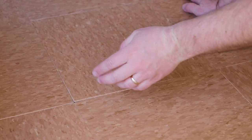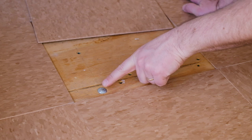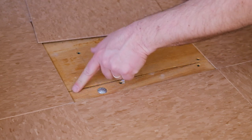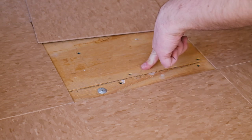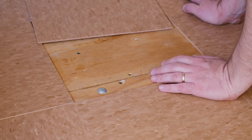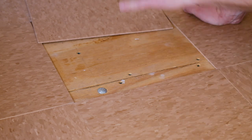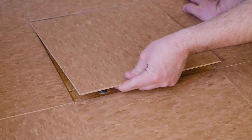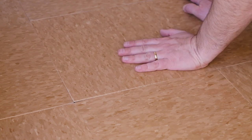One thing with VCT flooring is you don't get away with things like this carriage bolt sticking up, and where these two pieces have a little bit of an uneven gap — that will cause your tiles to crack. So you do need to put some underlayment under this. I'm going to have to go to the hardware store and get just the cheap quarter-inch underlayment material and tap down a sheet of that in here. The nice thing about that underlayment is if you decide you don't like the tiles, it's probably easier to pull up the underlayment than the tiles themselves.